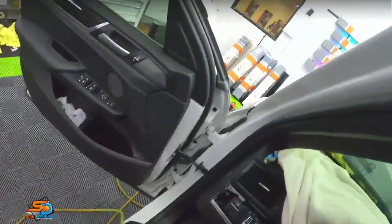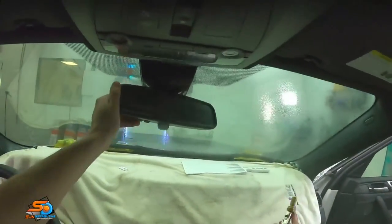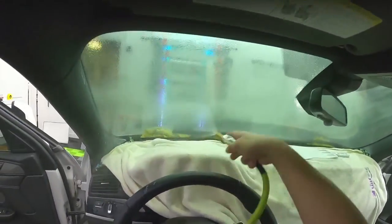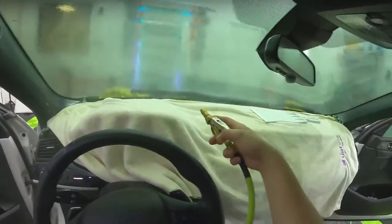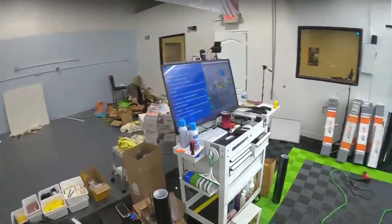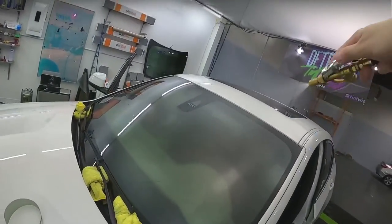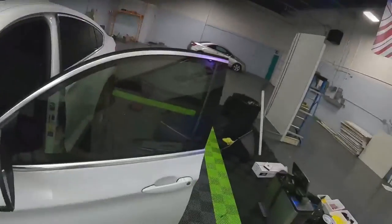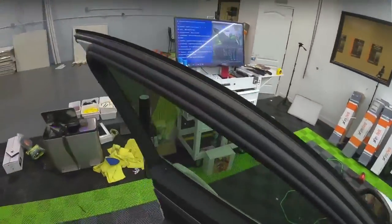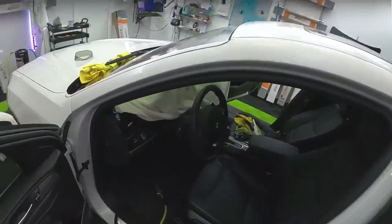Looking pretty handy. How long does that squeegee last? You'll nick it up — not in too much time. What I'm going to try to set up is a little station to sharpen the blades. If you take a straight edge and put the squeegee in a vise, you can just trim off a sliver of it and keep using the blade — it's all great material, you just got to keep that edge sharp.